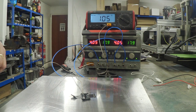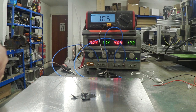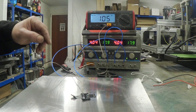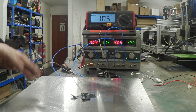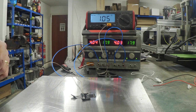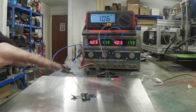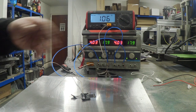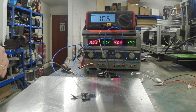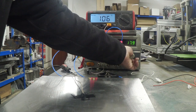It's drawing 32 volts at 8 amps — that makes it about 256 watts as a heater. I did try it at 12 volts and it only moved from room temperature by a few degrees. 24 volts works but it's quite slow — it took about 30 minutes to get up to temperature. Here at 32 volts, after nearly nine minutes we're getting quite high, and we can put that up to 48 volts. One way of controlling the heating speed is to adjust the voltage — keep it under 50 volts per low voltage regulations.